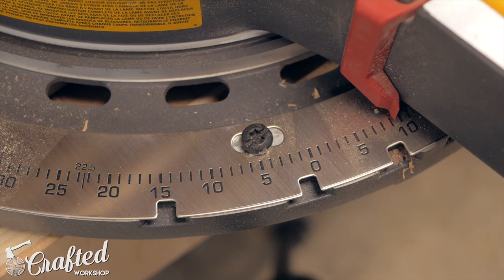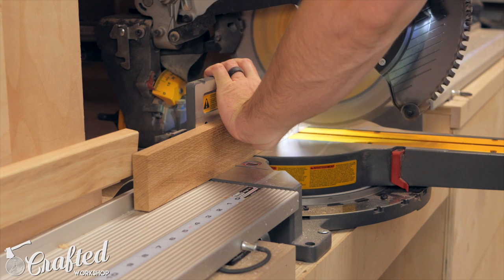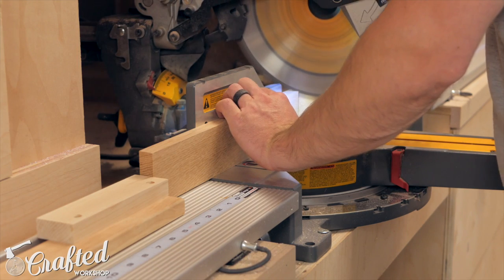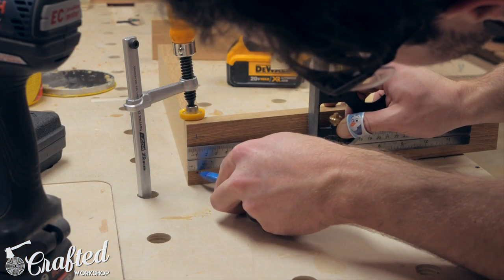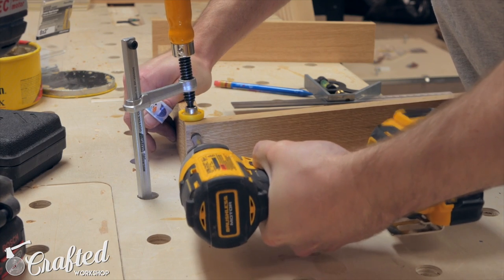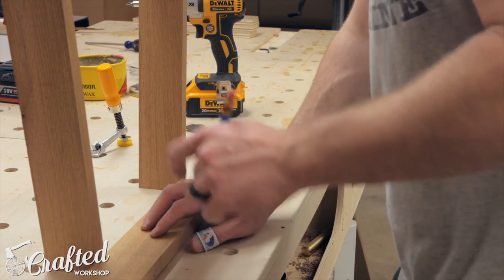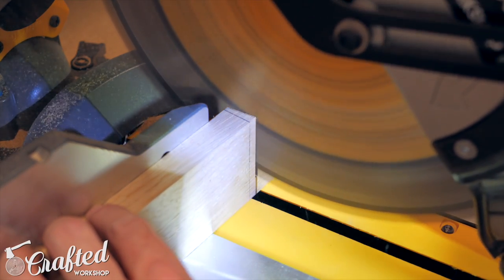The legs are pretty simple — they're just made up of four pieces joined with screws and dowels. All the pieces are cut with an eight-degree bevel on each end. The top piece and two sides are 14 inches long, and then I just cut the bottom piece to fit. The top and bottom pieces have an eight-degree bevel angled towards each other on each end, and the side pieces have the bevel cut parallel to each other on each end. To assemble the legs, I pre-drilled and countersunk holes, then added two-inch screws. I added a little paste wax to allow the screws to be driven more easily and used a clamp to keep the pieces flushed up during assembly. With the top and side pieces assembled, I marked a line on the bottom piece and cut it to exact length at the miter saw to account for any errors made while cutting the other pieces.